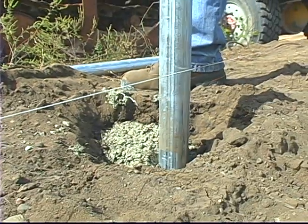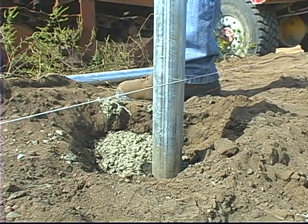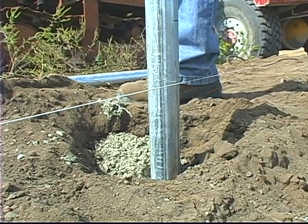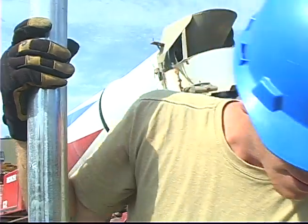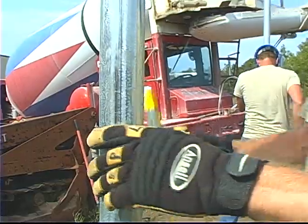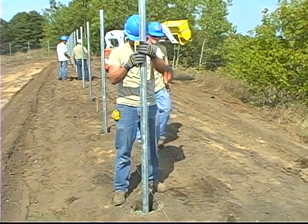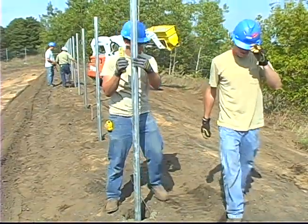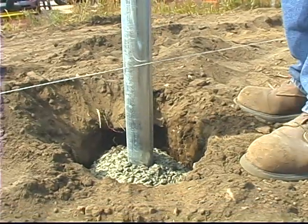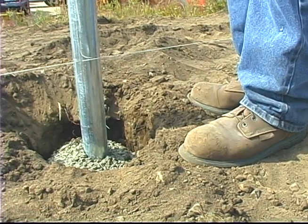All these posts have caps on so you don't have to worry about water getting into them. So whether the concrete is encased in it or not, it doesn't matter. Some people will put a post in the ground first and put concrete around it, which allows water to drain out too. But if the concrete ever separates from the post — which it shouldn't, but it might — it has a chance of settling and sinking in the sand below it, depending on the conditions of the ground.